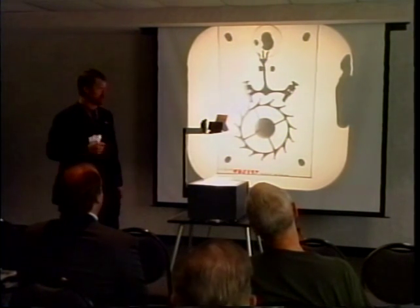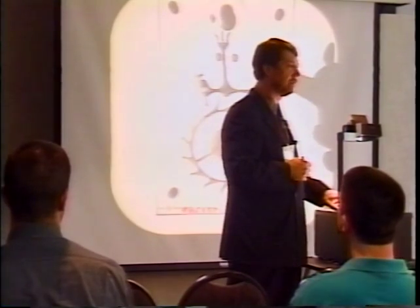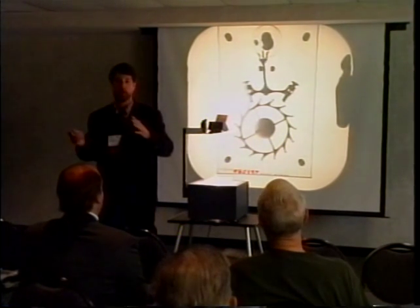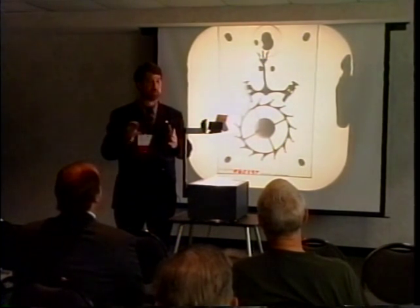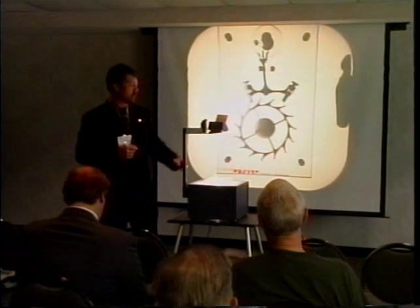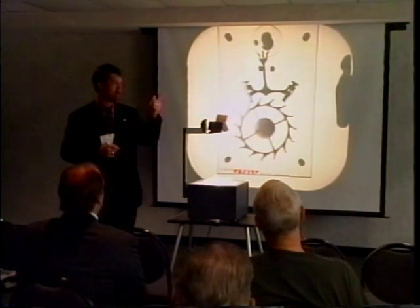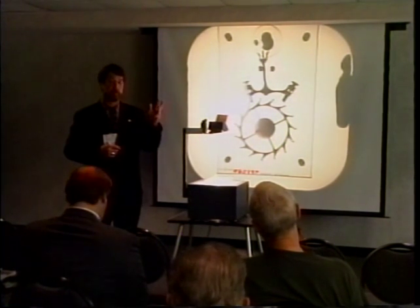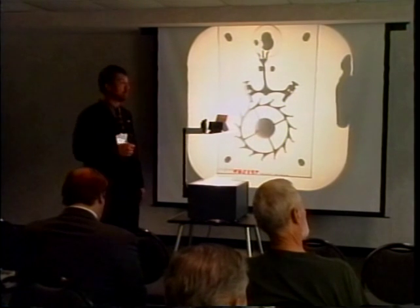Okay, so that's why we don't have to go and check the guard pin clearance again. We already checked the fork horn clearance to make sure it was equal on both sides, and the guard pins equal on both sides. If we wanted to, we could have compared the guard pin to the fork horn to make sure the guard pin was less than or equal to fork horn clearance. Then do the equal total locks, and then the safe lock check. So those four things: fork horn clearance, guard pin clearance, equal total lock, and safe total lock. Make sure you go back and make sure that it's a safe lock. Those four things.